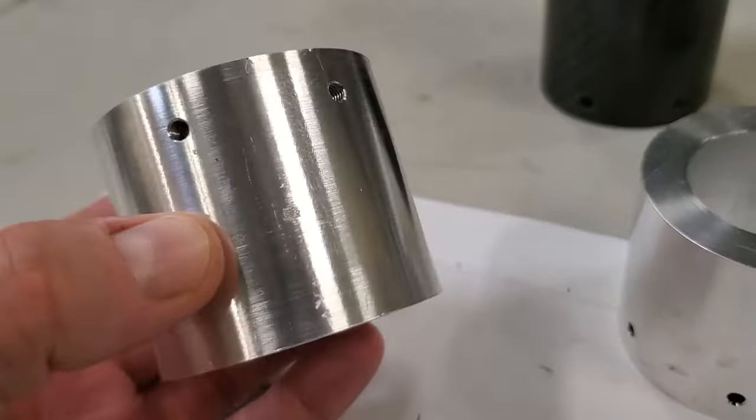Next, the plate that will join the azimuth axis to the altitude axis. I'm just checking to see how sturdy and secure it is. Now we set that aside and basically repeat this assembly for the altitude axis. Got a nice snug fit here. And install the harmonic drive the same as on the other axis. Also a snug fit.